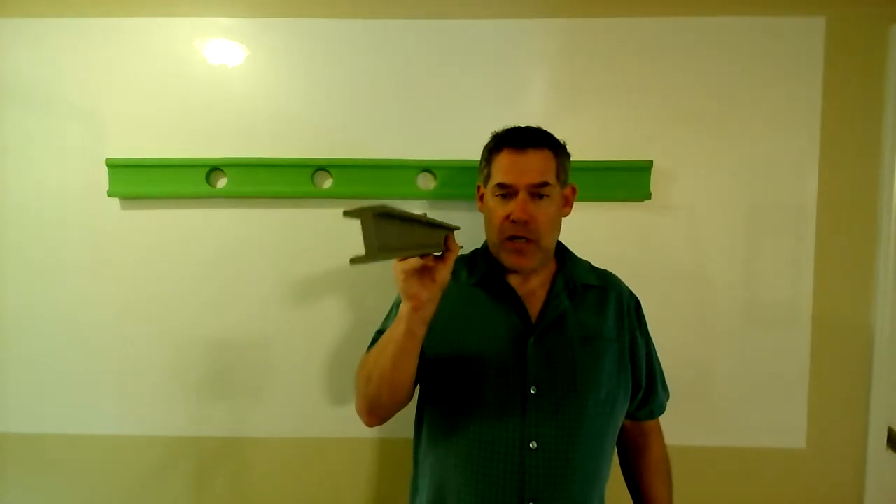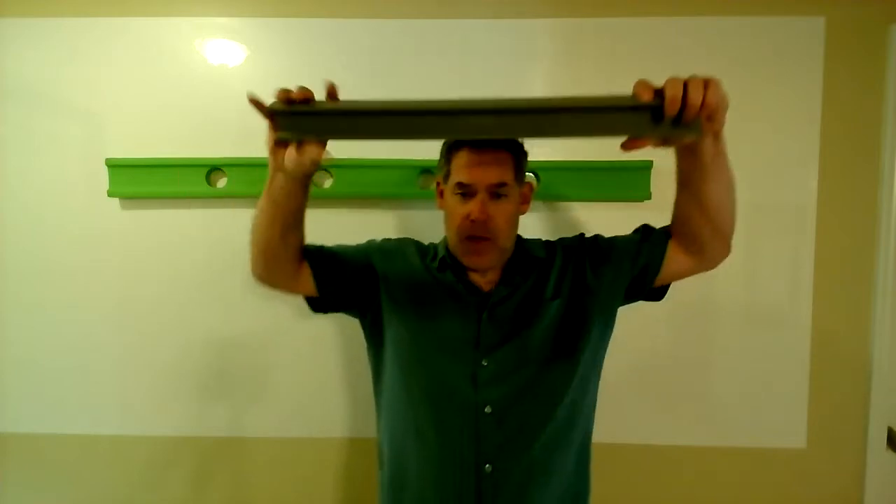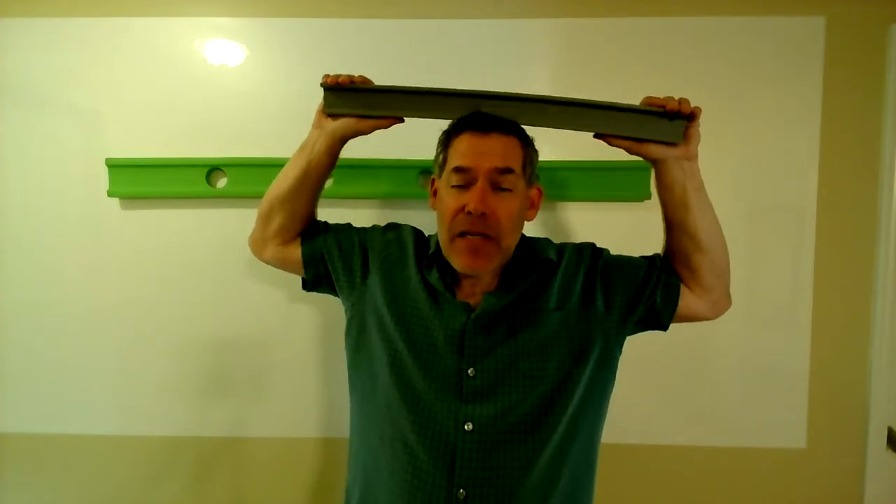Here's a more conventional cross-section that looks like a W-flange steel shape. And bending — that one's not so easy anymore. You can see it bending. This would be hogging curvature, frowning face.